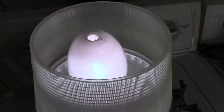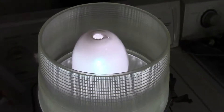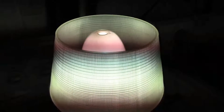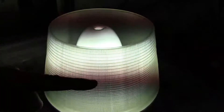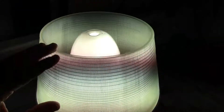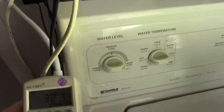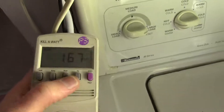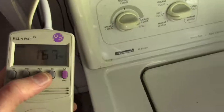That should mellow out as it warms up. After about 15 minutes it's now at full brightness. The bars you see crawling up the screen are due to the 120 Hz flicker of the light interacting with the shutter on the camera. The volt-amp draw has dropped back to 323, and true watts drawn is 167 — a little bit under the rated 175 watts.